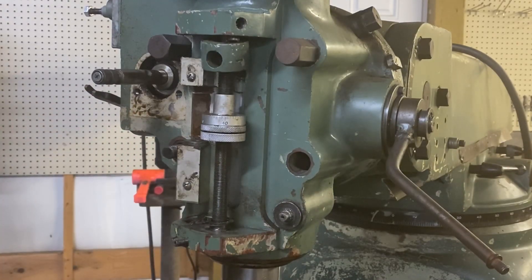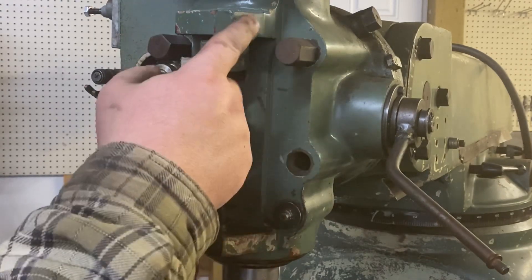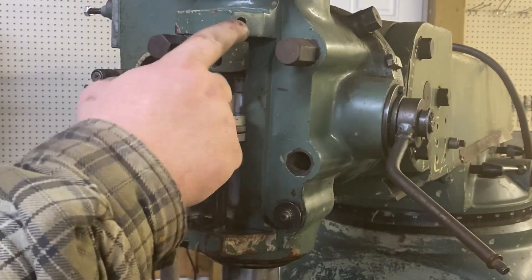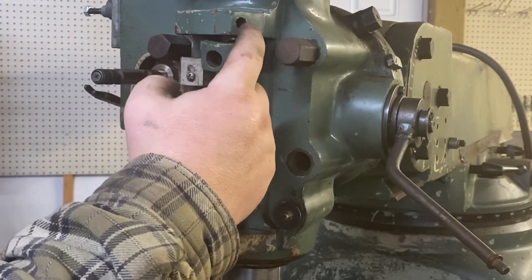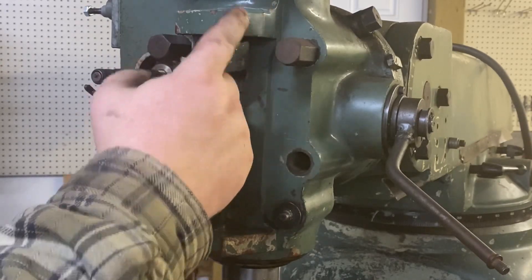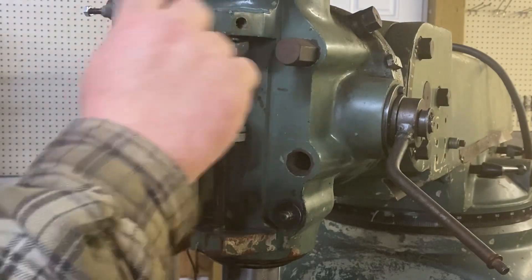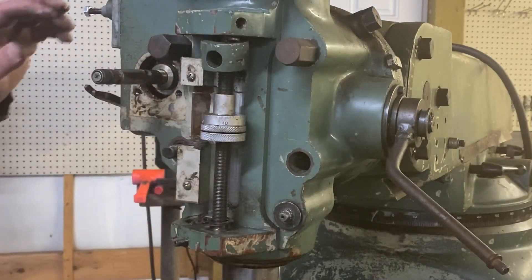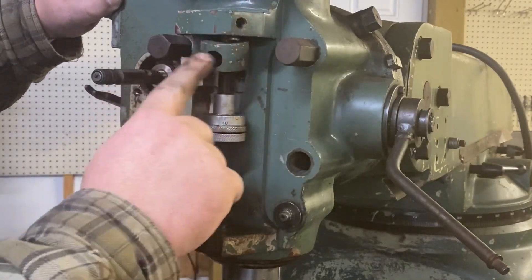Now it's just this part. I took out the set screw here. There's some kind of — I don't know if it's a pin. I hope it's not an Allen set screw, because when I took this apart the end of it was all shiny and it didn't look hexagonal anymore — like someone attempted to extract it when this broke and stripped it out.